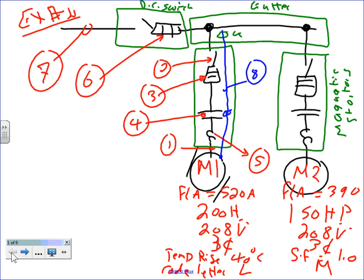So when they're going to come and change the oil in this motor, imagine somebody is changing the oil and the controller gets a message from the laptop to start while somebody's changing the oil or the bearing in this motor. You're going to kill somebody. So the people smarter than us decided, after we lost so many fingers inside the mixers and so forth, to come up with a physical mechanical isolation of the circuit. Those are physical mechanical knives that isolate the circuit mechanically, physically, electrically, and you completely de-energize the system, and then you lock it and you tag it like this. When you turn them off, you lock them, you tag them, so you make sure no one is going to turn the switch on while your hand is inside the mixer. That's where a disconnect comes in.